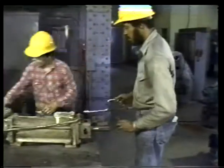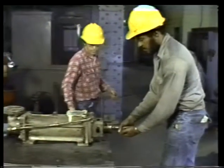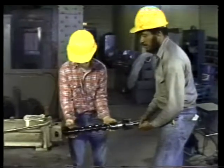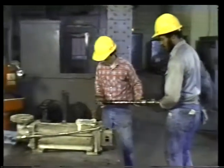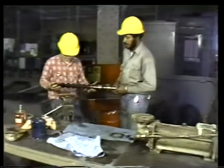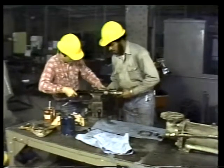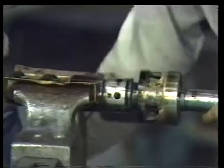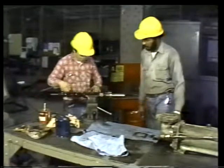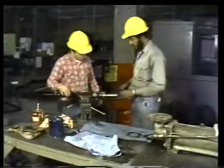The end plate is slipped off the end of the shaft and set aside with the casing bolts. Then the power rotor is gently drawn out of the pump. Having assistance helps prevent the rotor from banging against the lip of the casing. A table vise has already been set up to accept the rotor. Copper sheathing covers the jaws of the vise, preventing them from marring the precisely machined surface of the lands. The jaws should be tightened firmly enough to keep the rotor from shifting around.